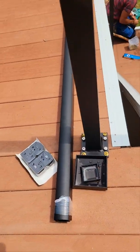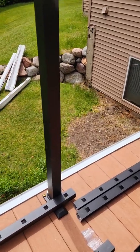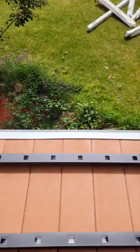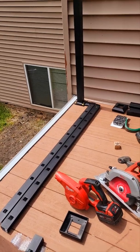And then I will walk around and I will take all the brackets and I will put them into the posts exactly where they need to be with my jig, so that once I'm done, as I move around in a circle, rather than wasting time just putting in a bunch of brackets wherever, I can get all these members cut, all of my top and bottom rail cut, and then I'll start again at my central location, or my first location, and I'll start installing brackets.